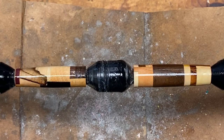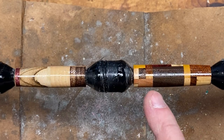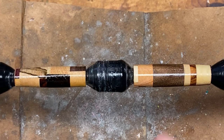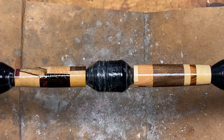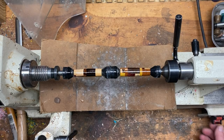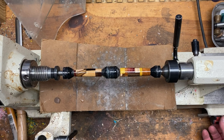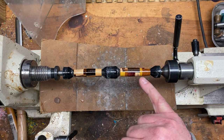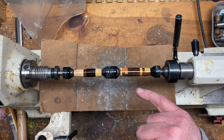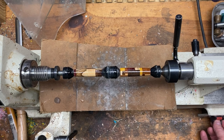Take a look at that when it's finally shined up. We're going to let it spin and let the denatured alcohol evaporate. This blank is good and dry and we're ready to apply our first coat of thin CA. Wow — it's really going to soak in. Because this is end-grain I normally use about five coats; we'll probably put seven or eight coats of thin on here. I can see how it's uneven — shiny in some spots, dry in others. I'll keep applying thin CA and letting it soak in until those dry areas disappear, then move on to medium CA. I did have a little panic moment when a hair got onto my blank — I was working feverishly to pull it out of the CA before it cured, and I was able to do that.